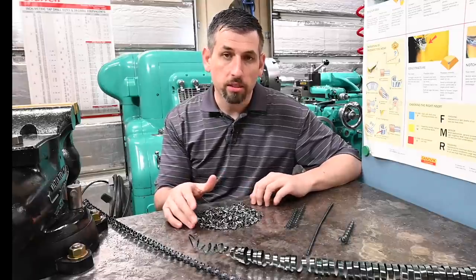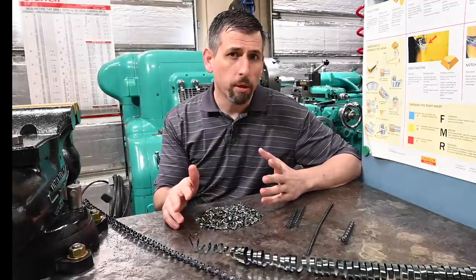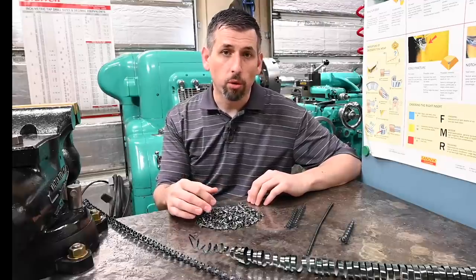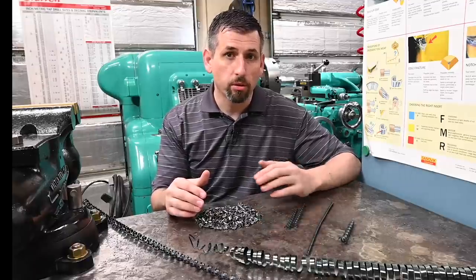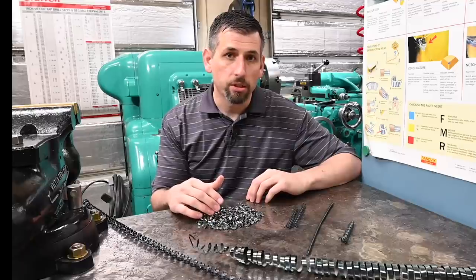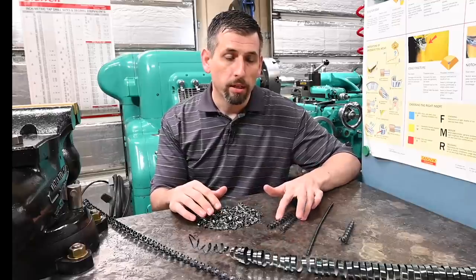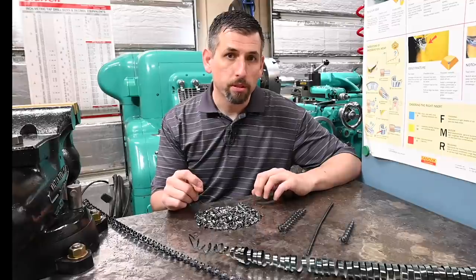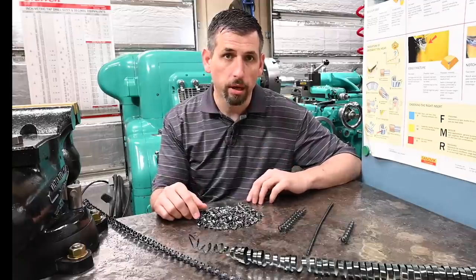So it's interesting to troubleshoot through stuff like this and find out what's going on, maybe what needs to change. Generally speaking, I've always been told and learned that if the chip isn't breaking, you need to feed it faster or increase the RPM of the machine. And in this case, a lot of suggestions were, nope, do the opposite, go a little bit slower and you might have better luck. I'm not sure where that would have been a better option in this progression of things if the tool post hadn't been broken, but it is something that I do have in my mind now.